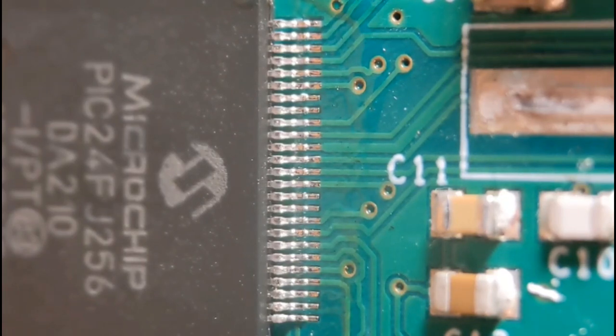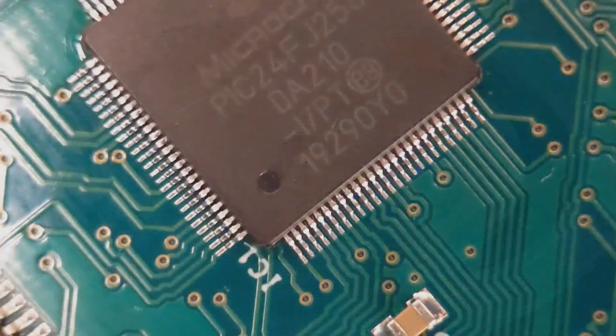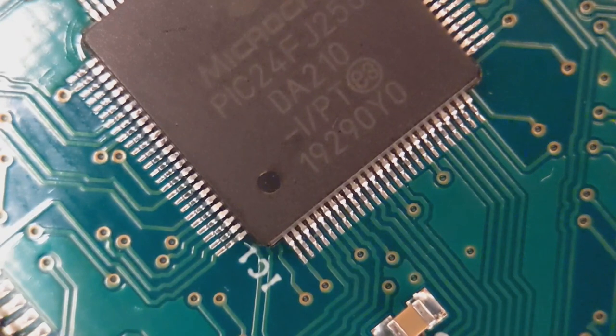I hope you enjoyed all the videos — if you did please like and subscribe. One correction: at the start of the video I said it was called a QFN, but it's actually a QFP. QFN has no leads and this one's obviously got leads, so this is a QFP. A couple of other points: if you can get yourself some 0.25mm solder that will really aid you when fitting these. It's available from a company called BLT Circuits, based in England. Also get yourself a small conical tip for your iron — you struggle with a big tip doing pin by pin. Get a conical one and you'll find it a lot easier. I hope you enjoyed the video — like and subscribe and I'll see you again soon. Thanks a lot.